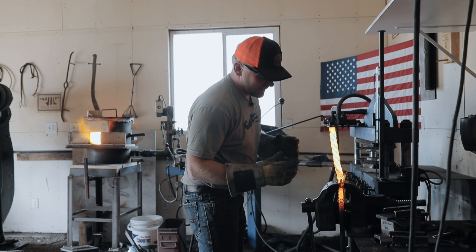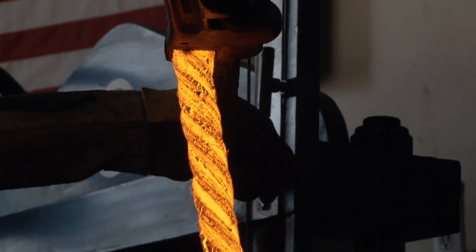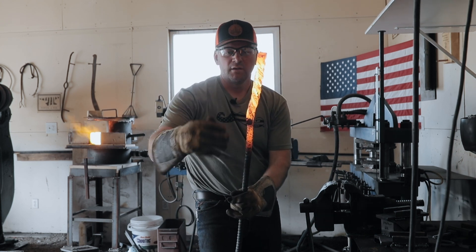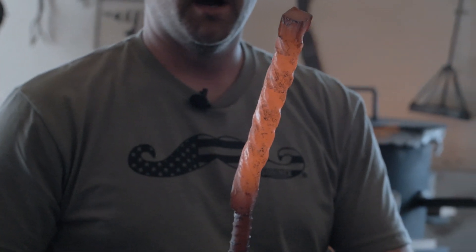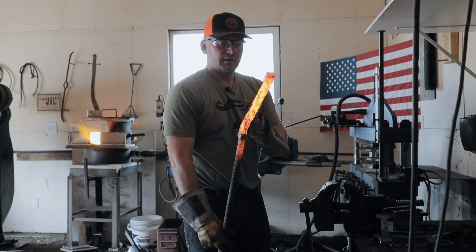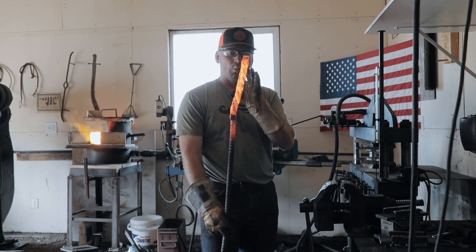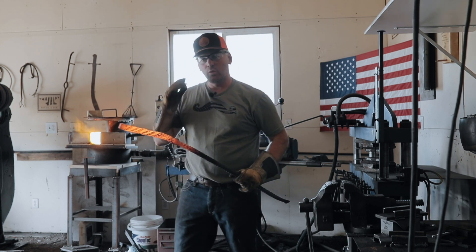I could keep going on that but I'm not going to, because I don't want to mangle up the end of the bar where I'll put it in my twister. As you can see, we're getting some super cool twisting going on in there — I'd just have to do that over and over again. The other reason I stopped is that my twisting bars want to hit my press, so I'd rather not get the billet all wonky. I'm going to straighten it out on the anvil and then we'll go into my twister.